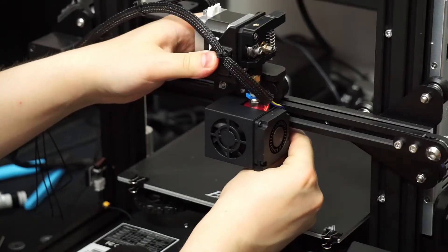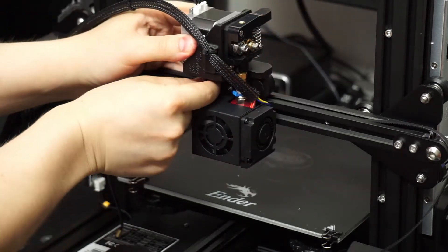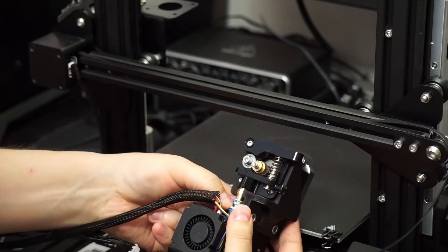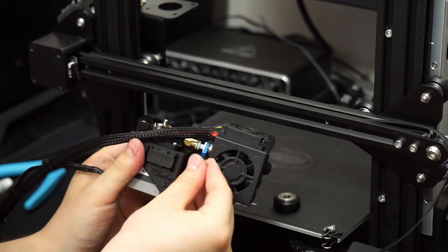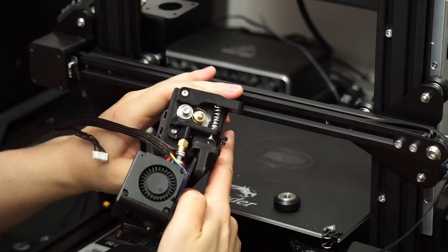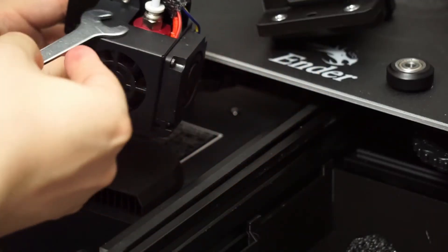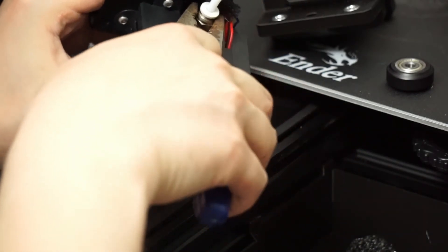If you've done the change I just showed you, it's going to be a lot easier to change the PTFE tube. We can start by disconnecting the belt ends. Take out the bolts that keep the rollers on. You can take the coupling clip off so you can push on the coupling. You might need to unscrew the top screw that's holding the hotend cover in place. Push on the coupling ring and pull on the extruder in a bending motion to get it off the hotend assembly. I've had zero luck trying to get the tube out without also taking the coupling out, so I'll just unscrew the whole coupling.